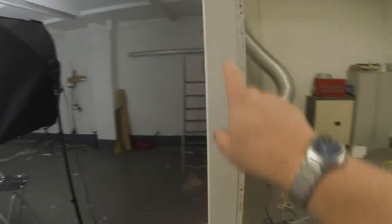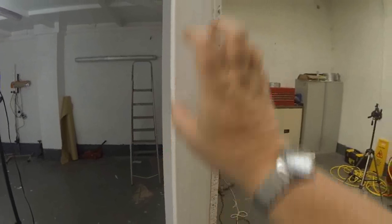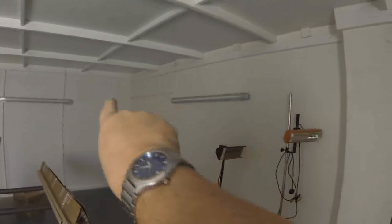The height for the panels, again, is 8 foot high, and we made them 8 foot high because that was the size of the panel, so we've done the frames accordingly. All the framework, as you can see, is made up of 3x2 studding, and that's all the woodwork you see around the side that completes all the frameworks, so that's pretty straightforward. We put a plate along the wall there, all the way around, fixed to the wall.